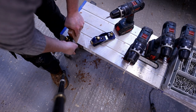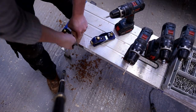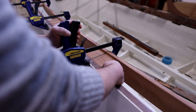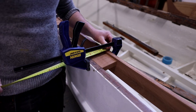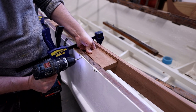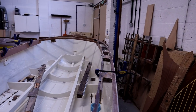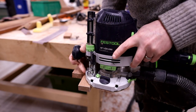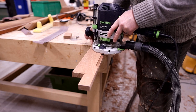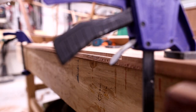Then it's a case of trimming in the last little bits of the edges with a block plane. These blocks incline slightly because the deck has a slight camber, so I'm just dialing in that angle to get it roughly right. The deck doesn't actually sit on these blocks — it rides from the carlin to the shear line timber — so they just need to be roughly the right angle so they don't get in the way when trimming the carlins. Those get epoxied in place with a little cleat timber underneath to support the vertical plane of the carlin. Then there's a little rebate on the back side for the ceiling boards that fit up into the carlins, which I'm cutting with a router and rebate cutter.